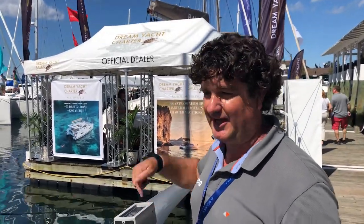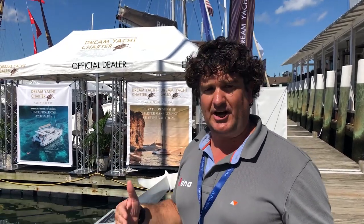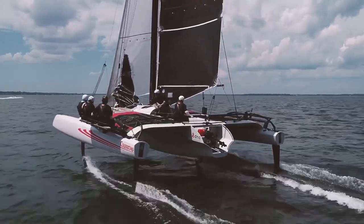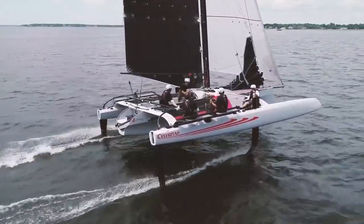You even use rudder differential to add some more righting moments. Can you explain what the rudder differential does? Well, we have lift on all the foils, but what you can do is on the windward side you can put more people on the deck to have more weight to prevent the boat from flipping over. With the big elevators in the rudders, if you give them negative lift it actually works like more crew sitting on the bench.